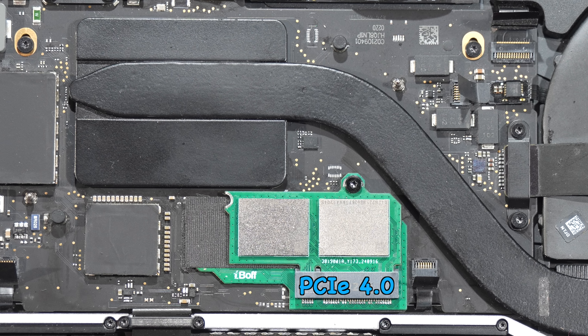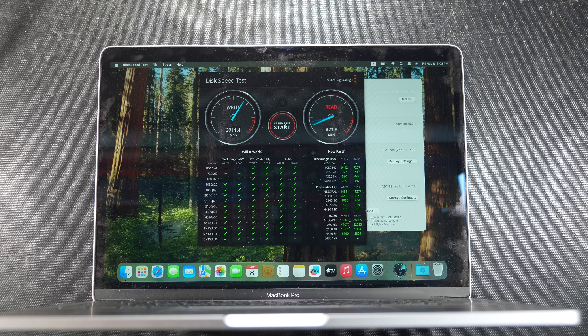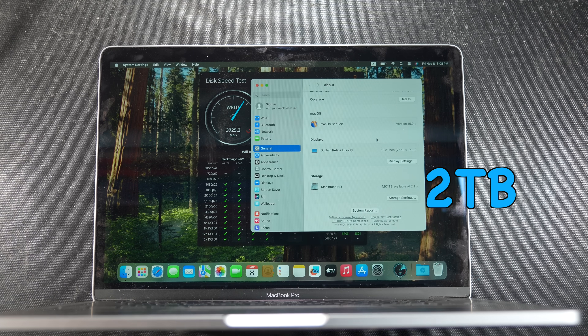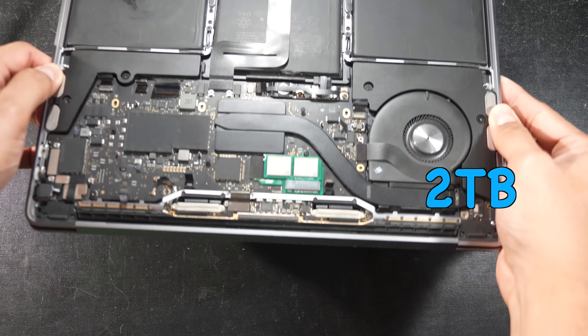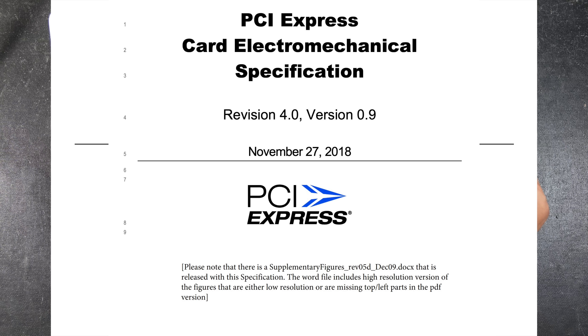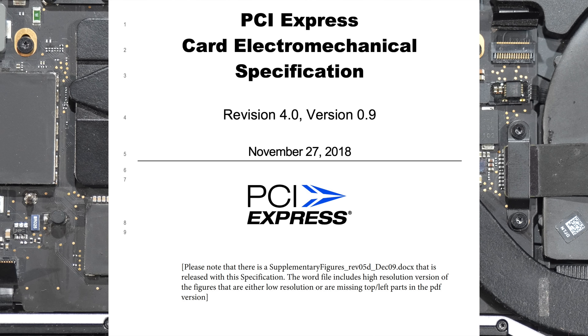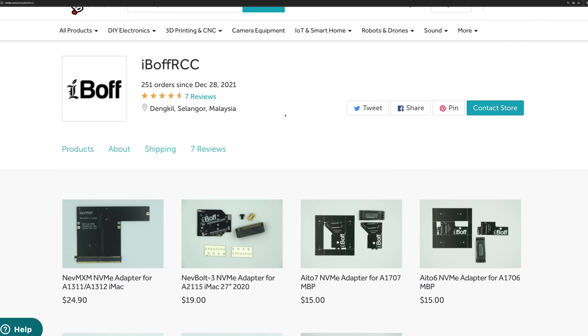The digital lanes on these NANDs operate at PCIe 4.0 speed, with each NAND connected to the M1 via PCIe x1, giving a speed of 1,500 MB/s per NAND. The total speed for RAID-0 NANDs will be around 3,000 MB/s for read and write — as tested before. If your PCB design is bad, you will never get this kind of stable speed. To achieve this, we needed to study the PCIe 2.0, 3.0, and 4.0 electromechanical specifications and all related documents for PCB design.